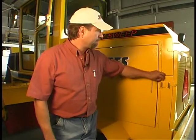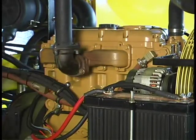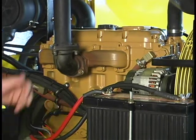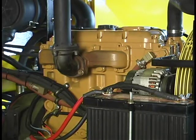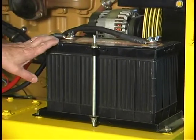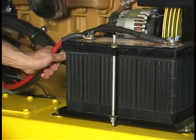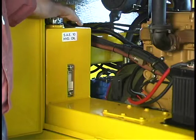Let's take a look at some of the major features of this broom. We use a Caterpillar 3054C engine that has a worldwide warranty. We also have John Deere and Cummins available on request. This is equipped with a Donaldson dual-stage air cleaner. We use a heavy-duty 925-amp battery with double-aught soldered battery cables, and a 35-gallon hydraulic tank with sight glass and easy fill.